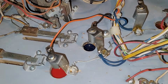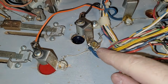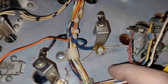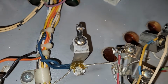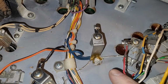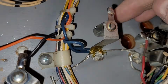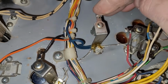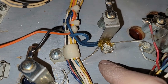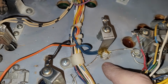I'll be right back. All right, here's where we're at. I've got these blue wires nicely soldered to this lamp socket. So that's happy. And these blue wires don't reach any lamp socket. So I added one. So one day in the future, someone is going to be working on this playfield, you know, like 2082, and they're going to be like, why the F is this lamp socket here? And what is it missing an insert? What's going on? Somebody drunk at the factory? But no, it's just the LEPing ways. That way I've got a good spot to solder my blue wires. So added a lamp socket, just a little bonus for the next guy if I ever sell this thing.